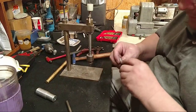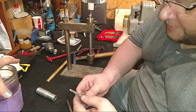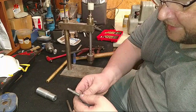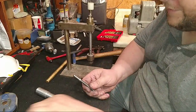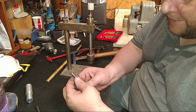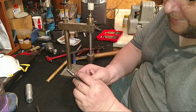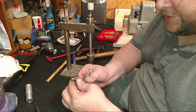What I'm doing is, Steve, Loctite this nut on there, but up in the casting, it wasn't fitting the casting. Nothing to do with Steve. Stephen Lang made this for me. Nothing to do with him. So I had to re-Loctite it and then tighten it back down. And I just got through peening the nut to go down in there and try to put a little dimples on the thread so that it doesn't back off.